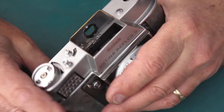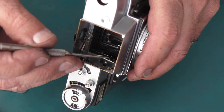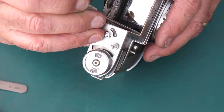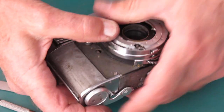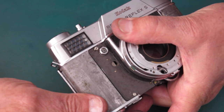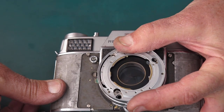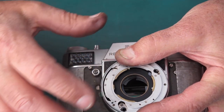The front's loosely sitting in place. You can see through here the cam is pushed over — it's not engaged correctly, so I've got to push that across to get it to drop into place in the body. That just dropped in. If I press the shutter release, that was the mirror coming up. Let's see what happens if we cock it. I just felt that tooth engage. Let's see if the shutter will cock — it's not cocking all the way.